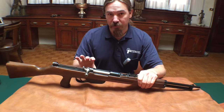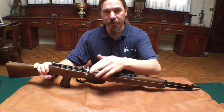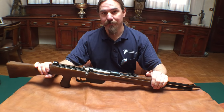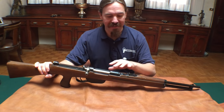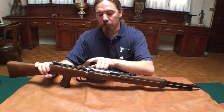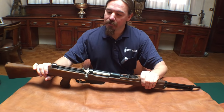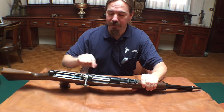You have to have some sort of track for the bolt to slide in. On a standard straight-pull rifle you don't really need that, because you've got a person manually controlling the bolt, and if it's a little sloppy and wiggly when fully open it doesn't really matter. But on this, because it's part of a fast-acting mechanical system, you want the bolt to be fully controlled in its entire range of travel. So you add an extension to the back of the receiver with a buffer at the end of travel.